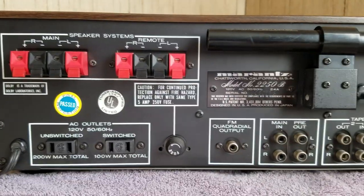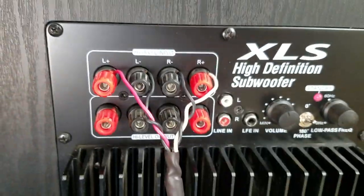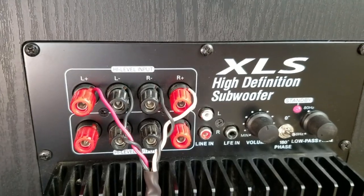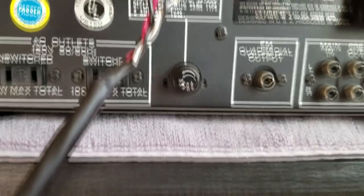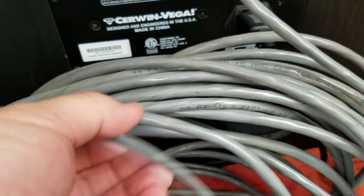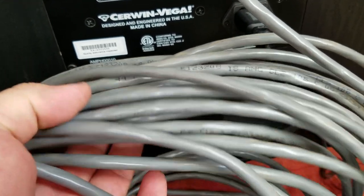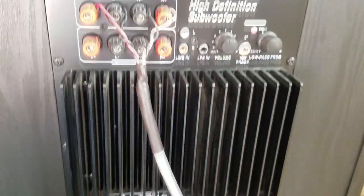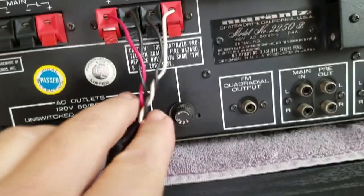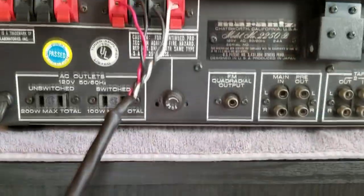I cut the length down — I didn't want to bore you showing the terminals, since we all know how to do this. Some people prefer banana plugs; I don't. What I'm using is some really good Belden six-strand home security cable — top quality American-made copper wire. What I did was strip it back, took the other two leads out since it's a six-conductor wire, heat-shrunk those, and made up this little harness. I have about 60 feet of it.